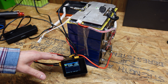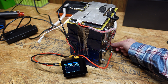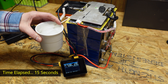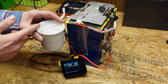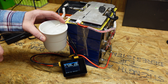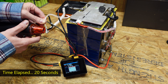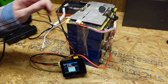Now we have the battery charging at 5 amps with the iCharger X6. The negative lead is going to the P-minus of the BMS and the positive lead is going to the main positive post. I've got a glass of frozen salt water here and we'll dip the sensor in — and as you can see, the battery is still charging because this is not an actual thermistor; it's simply a thermal switch that engages at a predefined temperature of 75 degrees Celsius. We should be able to simulate that with a heat gun, and we should see the charger shut off once the sensor reaches 75 Celsius. And there we go — output connection broken. This battery unfortunately does not have low temperature charging protection.